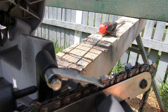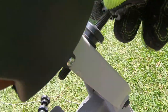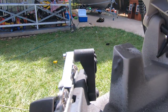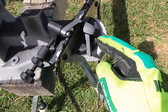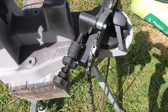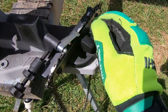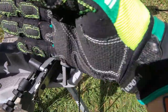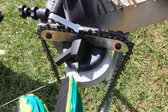That's done. I'll show you a few of the adjustments you have to set up. This on the back here is your depth adjustment — that pokes through there, you tighten it down with a locking nut, and that bumps against here and controls how deep your blade goes. We've got our angle, and we've got the chain adjustment here that adjusts how far your chain slides up inside the chain slider. I had to take this screw out, tighten that up, and put the screw back in so it actually grabs onto the chain. Other than that it's pretty straightforward — this angle is set, and you just put whatever degrees your chain is on both sides for whichever side the chain is sharpening.